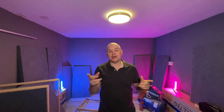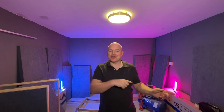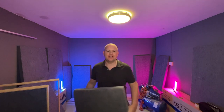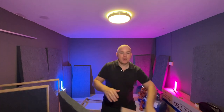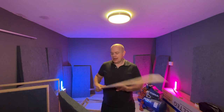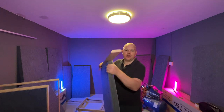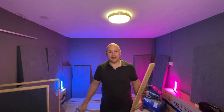Another update — quite a lot of progress yesterday. I was making the frames for the acoustic panels. I've got timber with a slightly wider-than-two-inch cross-section — about two and a half to three inches wide — which allows me to put a baton along the back to hold the panels in place. The frames are the same size as the insulation sheets. I've done simple joints rather than mitre joints since they'll be covered by the material anyway.